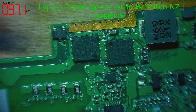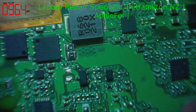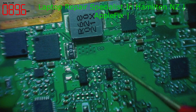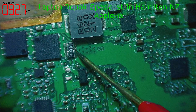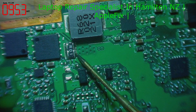Just to make sure, the problem is somewhere in this area. I'm using a power supply to confirm — injecting voltage here to check. It's not drawing any amps, which means the system on this side has no short.